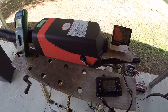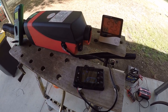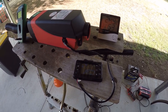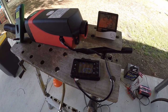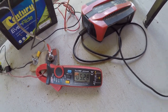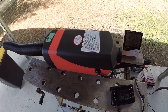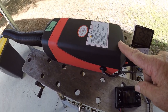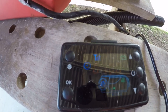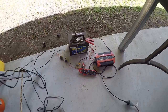It'll now go through its cool-down cycle. It slows the fan down, turns the glow plug on — you'll see the amperage increase — as it tries to blow out and ignite any unburned fuel. After the cool-down cycle the heater turns itself off, but the LED controller is still lit and we're drawing about 0.08 to 0.09 of an amp with nothing running. So it's advisable to put a master switch in the battery line.